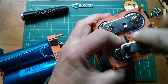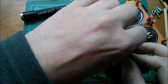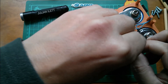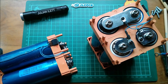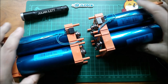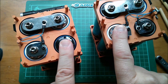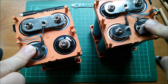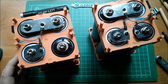Now you've got these half-blade connectors for the balance charge leads, which tend to rotate when you undo them — I'll try and prevent that. It's better if this isn't flailing about and risking a short, because there's a lot of current in these things. Looking at this again, I actually quite like this balance lead isolating arrangement so you can bring the two blocks apart. The 30-amp fuse connects these two, and then the final connections across the outer two give you the 25 volts for both charging and discharging.